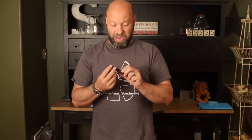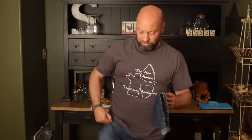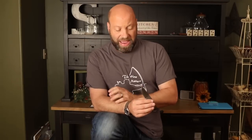Shaving is not the best way to check if a knife is sharp. Use a rubber band: pinch it between your fingers and run the blade across the slightly taut rubber band. If it cuts easily at every point you move it, it's good and sharp. This stropping system with denim blue jeans on your thigh will take your knives and broadheads to levels you've never seen before. Unless you're a very skilled sharpener with the right equipment, you're not going to beat this system.